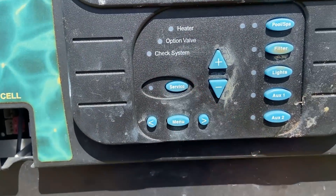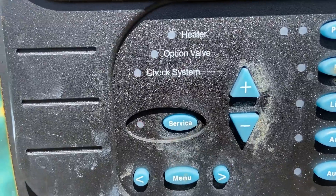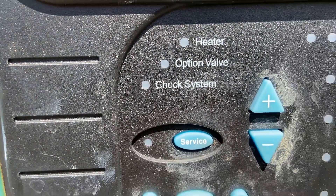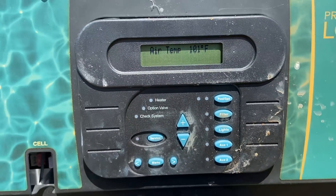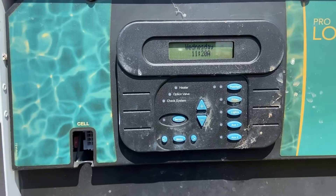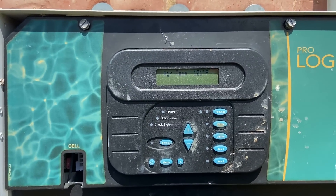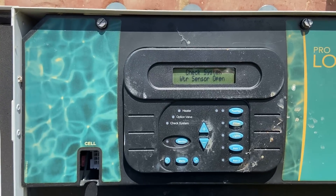When I first got here the pump was running. I hit that button and it's a solid light, then I hit it one more time and now it's a blinking light. That's what the procedures talk about as far as timeout mode. These kinds of systems — same with a Jandy — will stay in timeout mode for three hours.